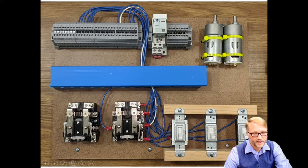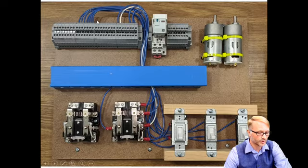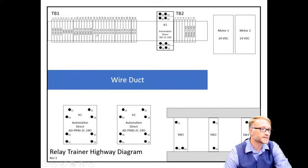Turns out that relays are kind of expensive, and if you're constantly screwing on these terminals, loosening and tightening them, they wear out fairly quickly. Whereas if I route them up here to the terminal blocks, they are very inexpensive, and they're fairly robust. Anyway, the point is that these relay wires are brought up to this terminal board. And you need to see what's what.